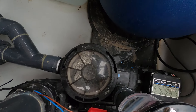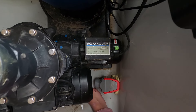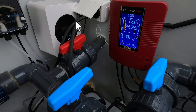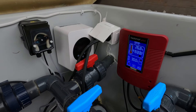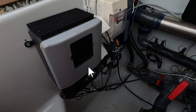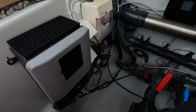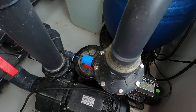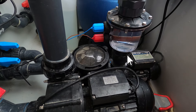The next step is the pump, equipped with its own pre-filter quite similar to the skimmer basket — a security measure to ensure no larger debris can proceed into the pump and damage it. We also purchased the Aqua Gem Saver, a frequency inverter that lets us change the speed of the pump to lower energy costs and reduce stress on the pump. The Saver is connected to the Aqua Xenic for full control of the flow speed depending on parameters such as whether the pool cover is on, the water needs treatment, and so on. The water then goes into the pump responsible for actual water circulation before being pumped into a copper and silver anode ionization chamber.